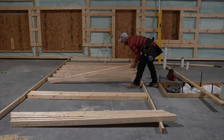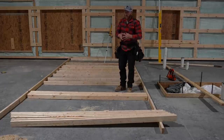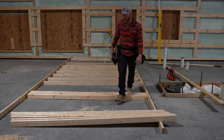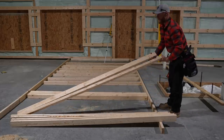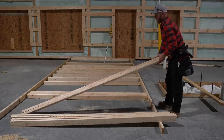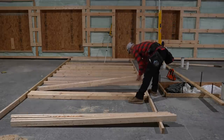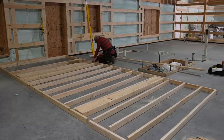Now, the way I was always taught to do your walls, the inside of rooms, or if you have cabinetry, run your crown to the outside. Now, we're obviously crowning all these boards, looking to utilize the best crowned boards or the straightest boards that we can, but you're gonna get some boards that just aren't perfectly straight, and you always wanna run all of your crown the same direction.